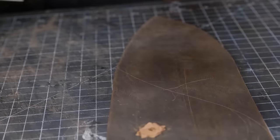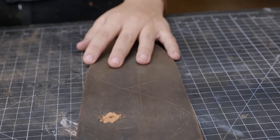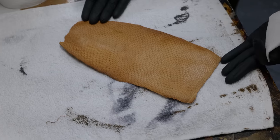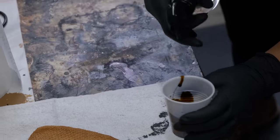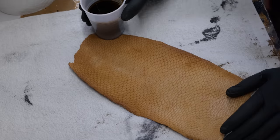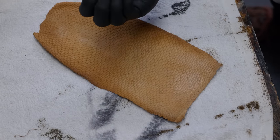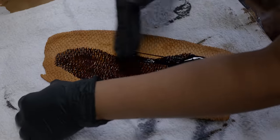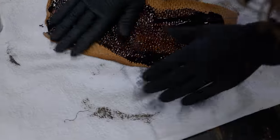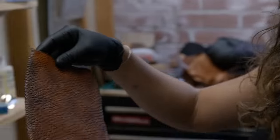We're going to put some beaver tail on it first, because pretty things make people happy. We've got our beaver tail and our little concoction of dye. Spray a little water to thin it down. With the beaver tail, I like to go against the grain so it gets in all the little cracks and you can see the texture just comes to life. Give it the old swipey-swipe. The beaver tail is very beautiful — you can see all the texture in there.